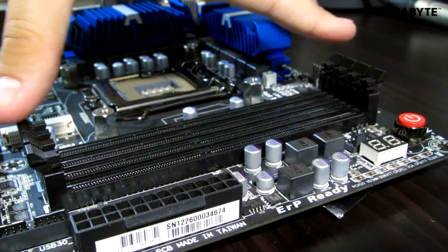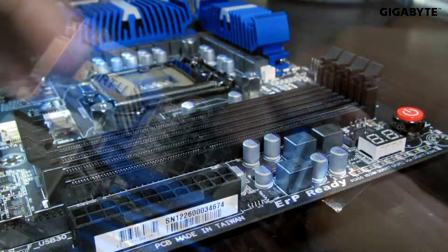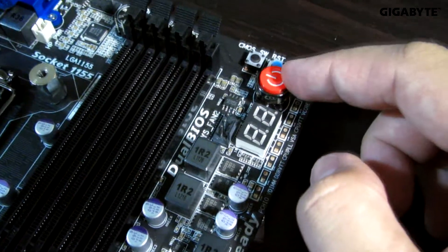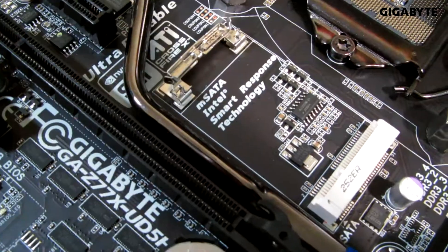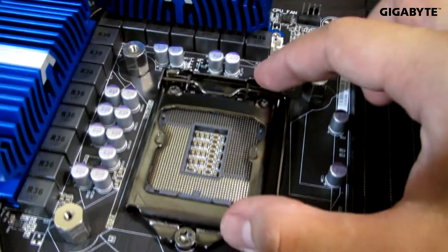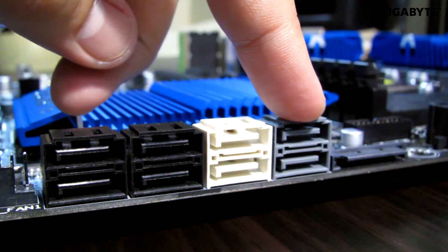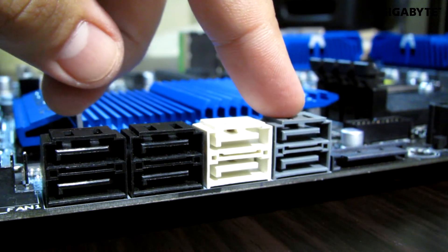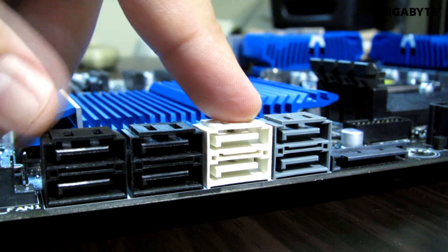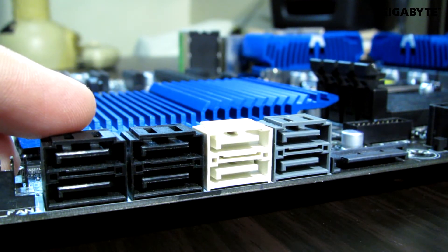We have 4 DIMM slots that support up to 32GB of memory, which would be very useful for people who do heavy HD video encoding and 3D rendering. This is the 8-pin 12V power connector for powering your CPU, and this is the 24-pin for powering your motherboard. Onboard power switch. Debug LED. mSATA slot for your mSATA SSD. This is the VIA VT6308P FireWire controller chip, and this would be your CPU socket. We have a total of 8 SATA ports for your hard drives — 4 SATA 3.0 ports. The 2 grey ports are SATA 3.0 capable and powered by the Marvell SE9172 controller, the 2 white ones are SATA 3.0 also, and the remaining black ones are SATA 2.0. Keep in mind that the SATA 5 port will be automatically disabled when the mSATA slot is used.